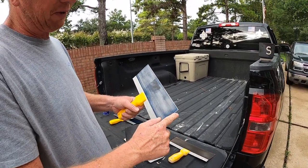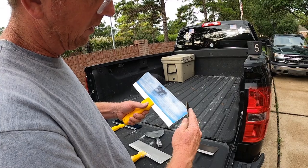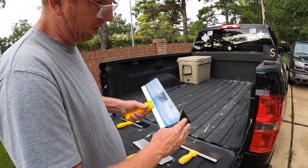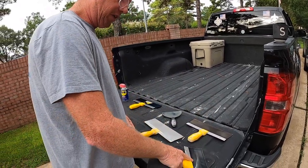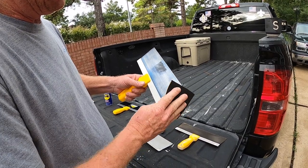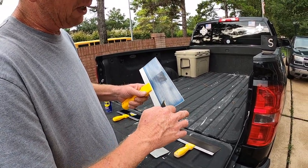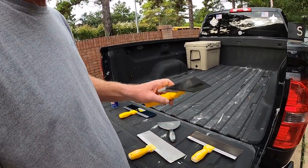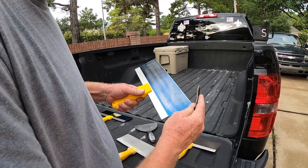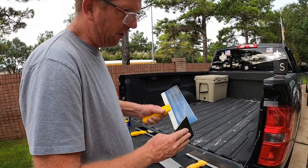Now we've got both sides tarnished and the blade where you can see silver, so you know you knocked that square down. The most important part is this little sharp corner. Very slightly, I'll take that — not putting a lot of pressure, you don't want to go too far — but you want to knock that point off, because that point will dig into your wall and into the mud. When you feather edge with one side down, if you've got a point it'll scratch the wall as it comes brand new. Knock that corner down just a little bit on both sides.